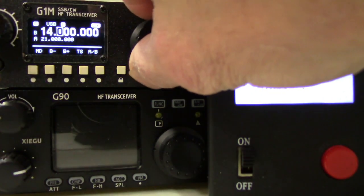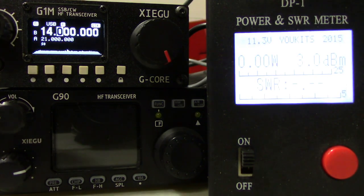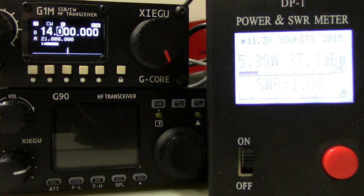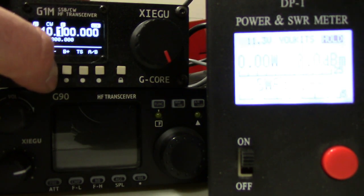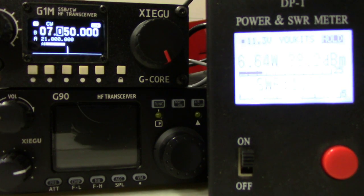Our steps — we can adjust our steps and go through. Right now I am in upper sideband mode on the radio, so I would actually go to this mode button if I chose CW. I am into a dummy load here, and if I transmit on CW, I have 5.39 watts out — 5.45 on hold — on 20 meters. If I choose another band and go down, it transmits on 40 meters and we have 6.67 watts out into the dummy load.